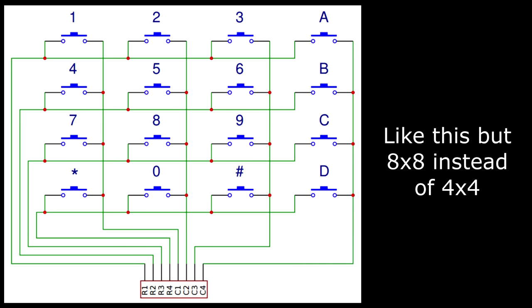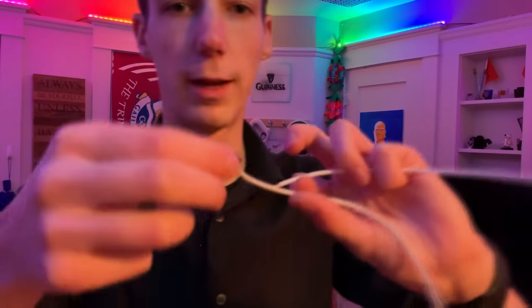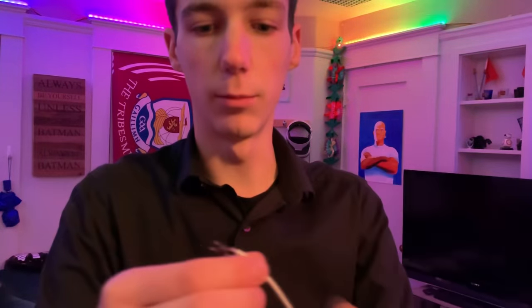and we can use that information to update the LEDs. So for the buttons, what I'm going to do is go in and start by flattening out pins. Then I'm going to solder one wire to either end and just make a grid of this. I'm going to do this off camera, because it is going to take a while and it's going to be extremely boring.